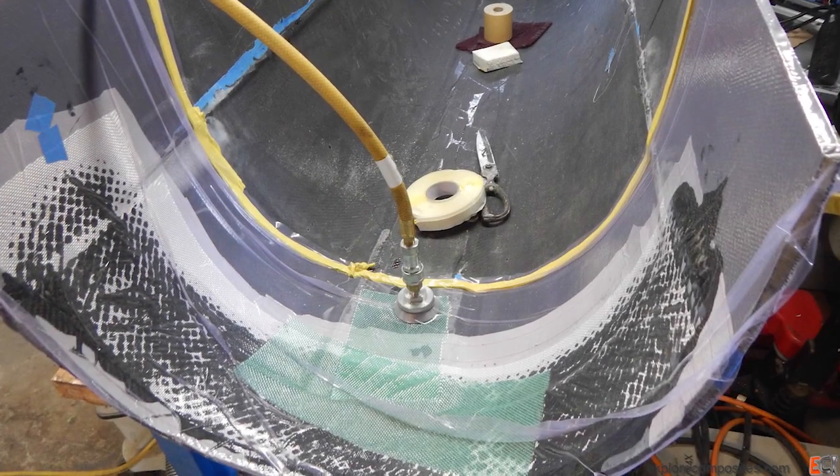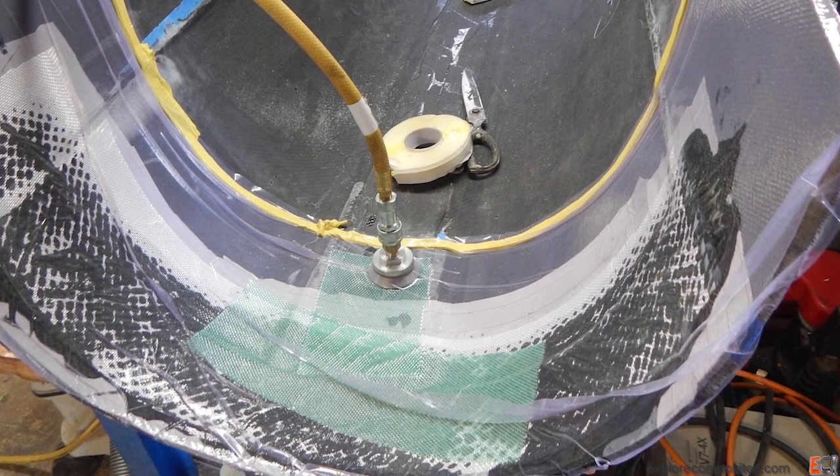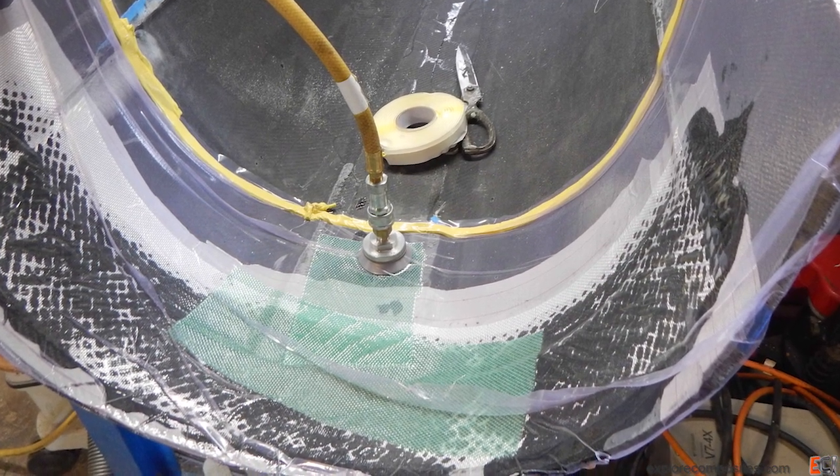Because the thing was done in one shot, there's some distortion in the weave. And on the inside, a couple of places where the core had slid up and I had to grind through and do a repair in the back, and add a little bit more laminate around the trailing edge of the part where it would get cut, so it's not super sharp.